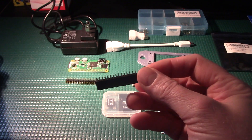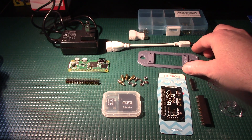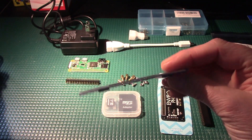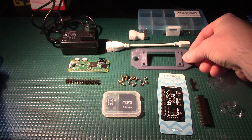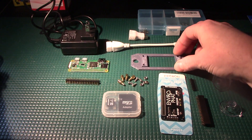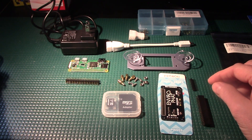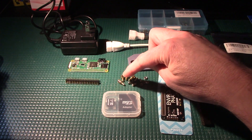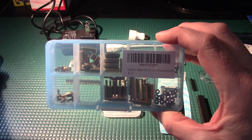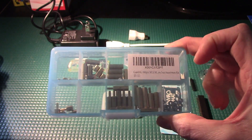I still have to solder the header onto the P hat as well. In order to hold this onto the dryer and mount it, I designed this very simple 3D printed plate to hold the Raspberry Pi Zero. I sized it to fit these suction cups that I found at a craft store — you can just plug the suction cups in here and then it can stick to the dryer. I use M2.5 hardware from Amazon to mount the Pi to the plate — buying it in bulk is a lot cheaper for these Raspberry Pi type projects.